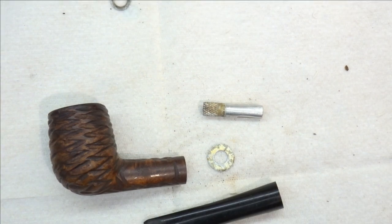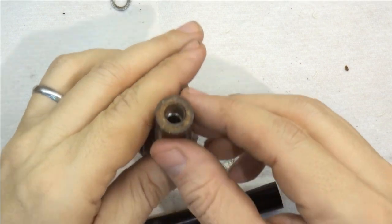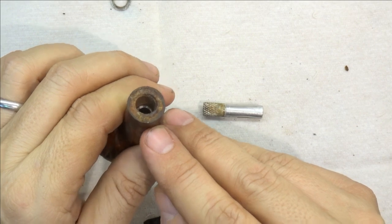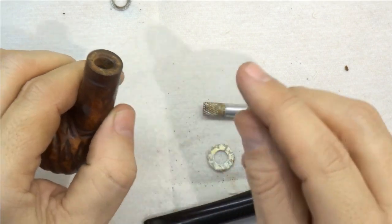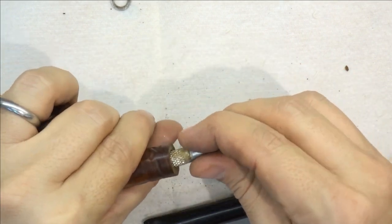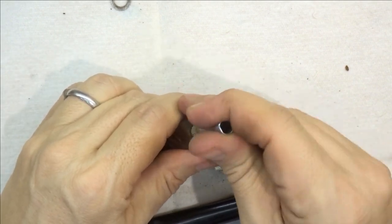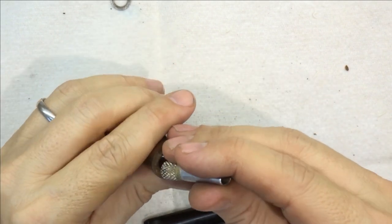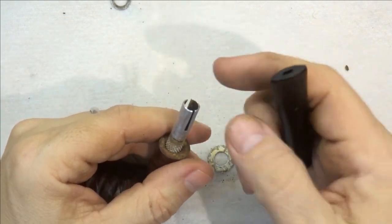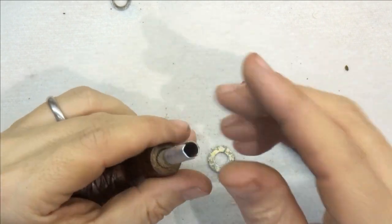All right, so I'm hopeful that video came out over at the drill press, but what we have done now is we have drilled away the aluminum insert down to 1/2 inch, which is the distance of this knurling on this part, and I'm happy it's actually a pretty good press fit, which is what I was hoping for. I'm not going to push it in there because I may have trouble getting it out, which is good. So that's all great. We won't know how well we line up until obviously this is put in place and we have to trim some off of this, but that's okay.